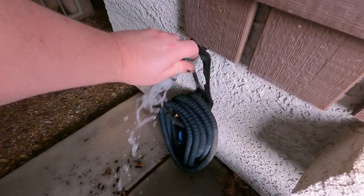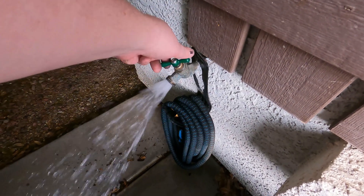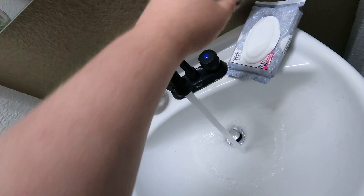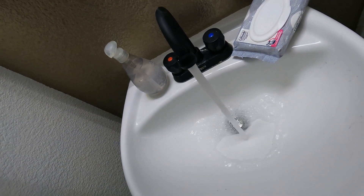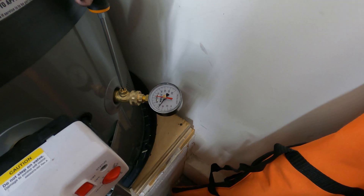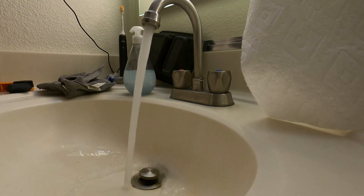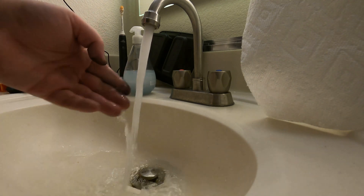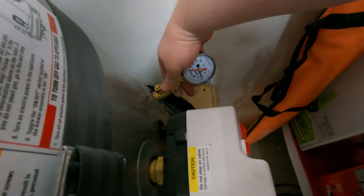Now we just need to get the air out of the line. We want to check the hot water as well. We'll let that run for about 30 seconds and see what we've got. We're now at just above 50 PSI. So we actually have less pressure, but it didn't drop at all when we flushed — that's exactly what I was looking for. The flow problem is resolved.